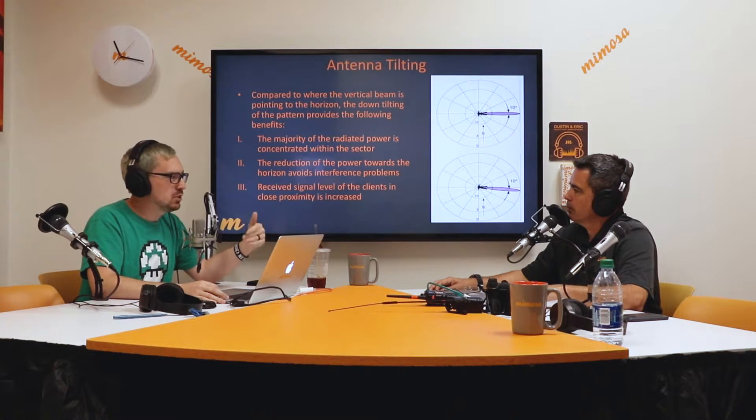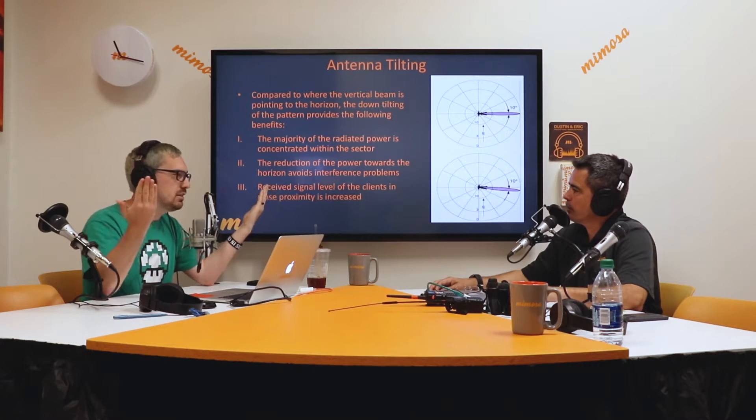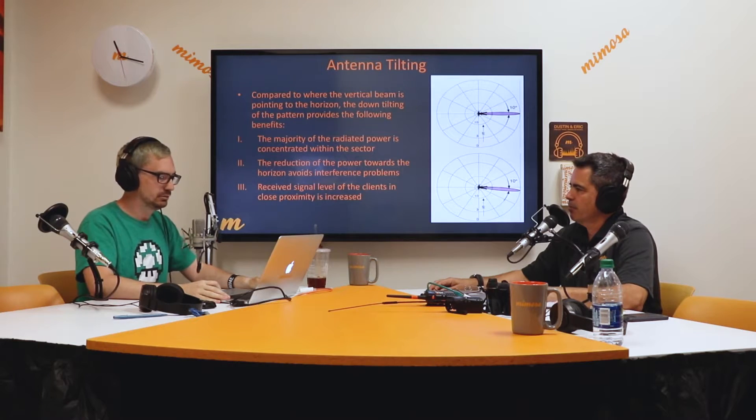Up and down, you do the exact same thing. You might end up on a side lobe if you're not doing the full range of up and down on your radio. Same for the other end of the link, because you're aiming for the best possible signal you can get. But I know tons of people — I'm even guilty of this years ago — where I just get a link and I was happy and it worked. But most often you could get much better if you spend the extra time doing that.